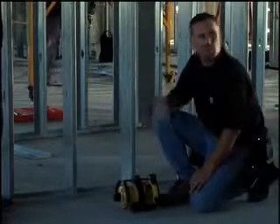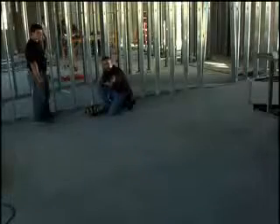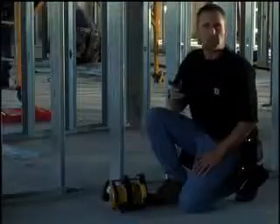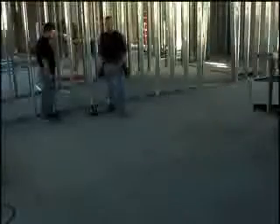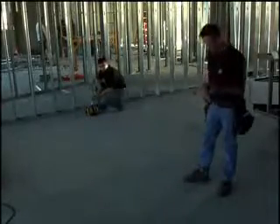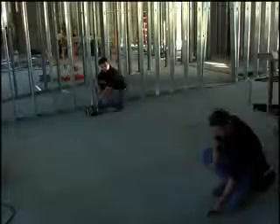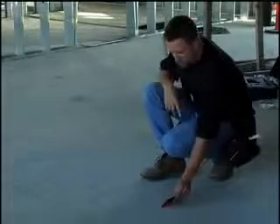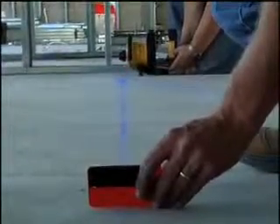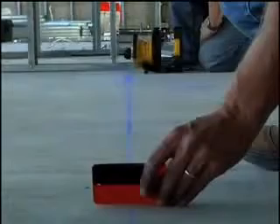It's absolutely critical that you use the center of the laser beam. Now that the laser is spinning, the laser is plumb. The hard part about doing a rotating laser is getting the rest of the laser plane to line up with the chalk line. So Dan and I are going to show you the old way: one guy is down on this end by the laser, and there's another guy on the other end with a laser reflector card. I'm going to hold one of the lines on the chalk line and tell Dan which way to turn the laser. Dan tried to move it a half of an inch but probably moved it about three inches too far.